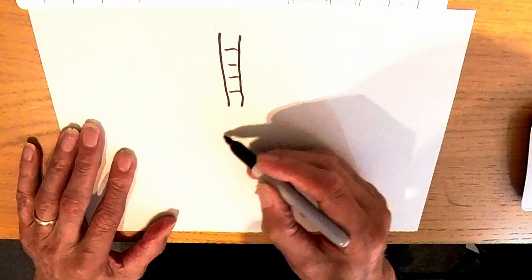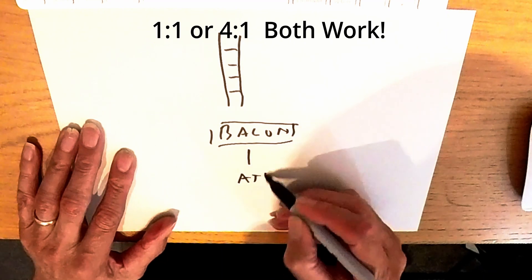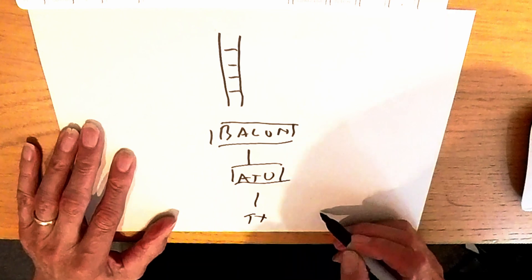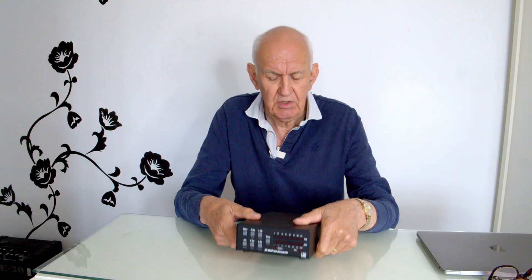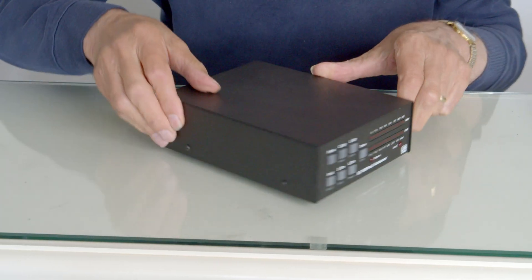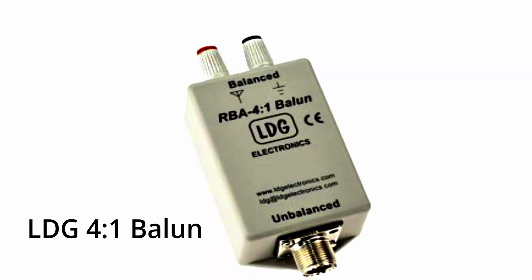When it comes to antenna tuners, I tend to favour a tuner which is fairly simple, and I use a separate balun. The reason I do that is because I like to have a bit of coax cable coming from the tuner, through the window or through the wall, to a balun just outside. A simple tuner like this LDG tuner here is the one I use most frequently — it's rated at 100 watts and handles 100 watts very easily — and I then have a short length of coax cable going from the tuner through the wall to a balun just outside.